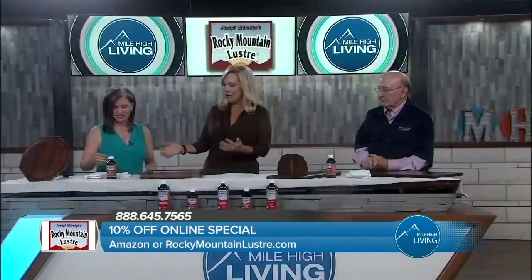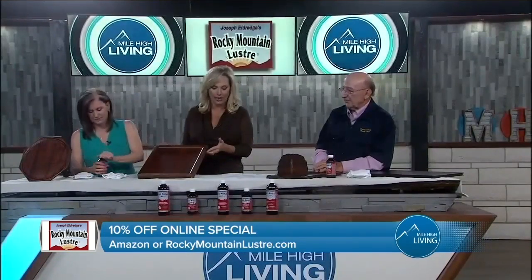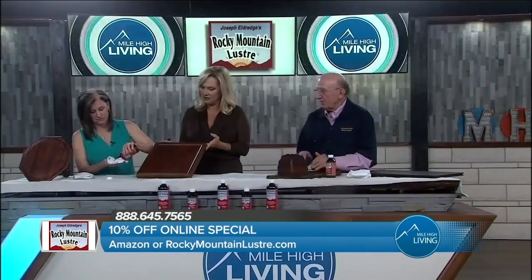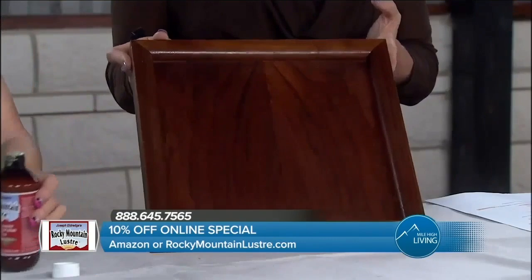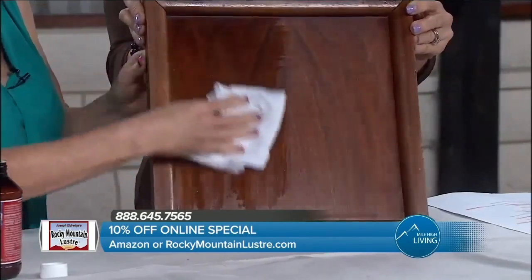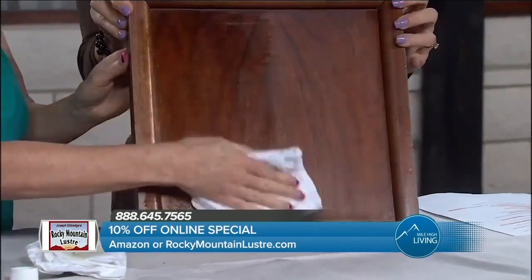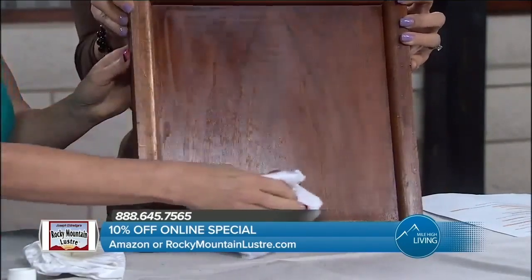Let's see how some of this works. She shook it up very rigorously so all the product comes together — the oil and the cleaner. She's putting an ample amount on the cloth. As she's wiping it on the wood, it's pulling out the dirt and any products that are on there. So it's pulling out the dirt at the same time it's applying a natural oil to the wood. Once you get it on there, take a dry rag and wipe off all the dirt it pulls out, wipe off the excess oil, and a thin membrane will remain on your wood.